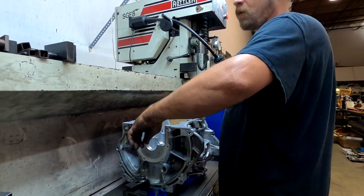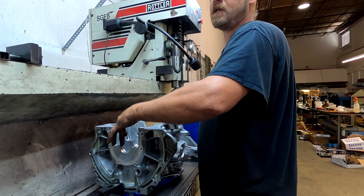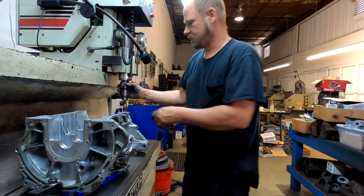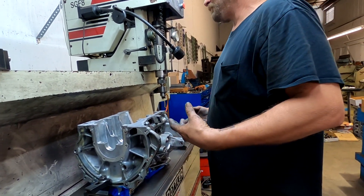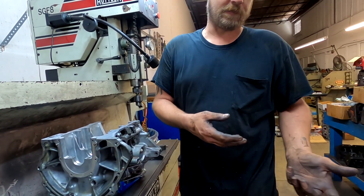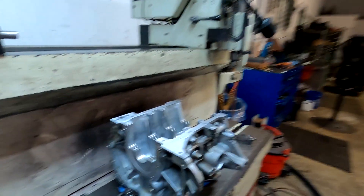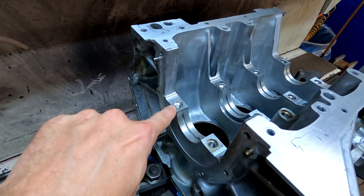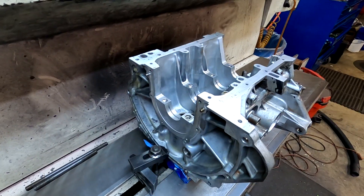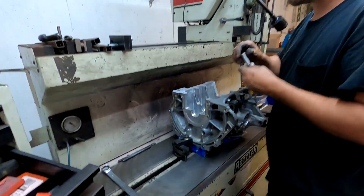I can either cut the hole bigger and thread the aluminum, or cut the hole even bigger and put a steel insert in for the threads. Typically I have no problem leaving it as aluminum — it just depends on the customer. I think we'll run it as aluminum for now, and when I get to actually torquing everything down I'll see how much torque it actually takes. If I have any issues I'll put steel inserts in. Basically we have the option of a threaded steel insert rather than just threading into the aluminum to get a better bite and more torque — we'll see where it comes in with just re-threading to 10mm, and if it needs more we can always add the insert later.